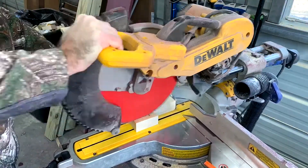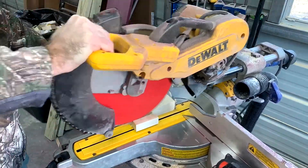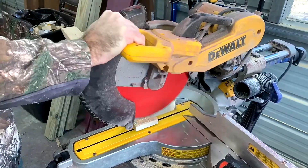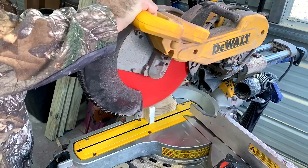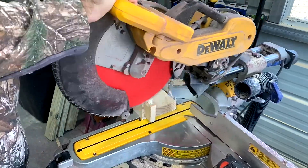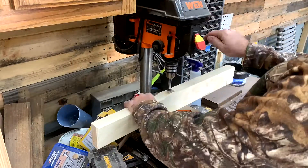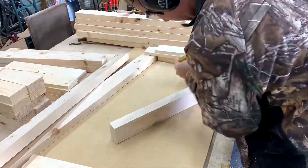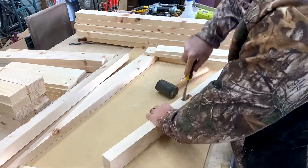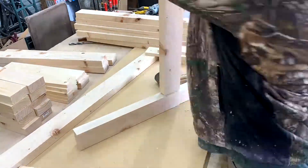This is me attempting to make mortise and tenon joints. I don't have a dado blade so this is what I came up with. I just put the stop on my miter and it goes to a certain height, so I just go around the board until the tenon is made. Then I move over to the drill press and make the mortise. After I get the hole drilled out for the mortise, I use my chisel to chisel it out, make it square, and keep doing that until the tenon fits in.